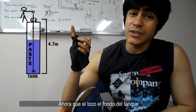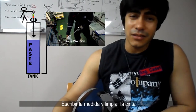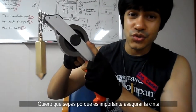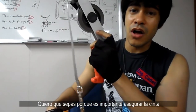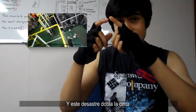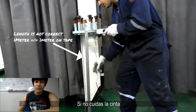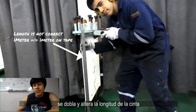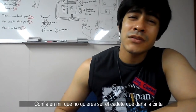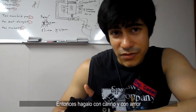Now that the bob hit the bottom of the tank, you can pull out the sounding tape until you reach the measurement. Write down the measurement and clean the tape properly. I need to ensure that you know why it's important to always lock the tape. If you don't lock the tape, it becomes a mess, and this mess creates little bends on the tape. If you don't take proper care, these bends will eventually alter the length of the tape, which means you're going to have incorrect soundings each time you use it. Trust me, you don't want to be the cadet who screws up the sounding tape.